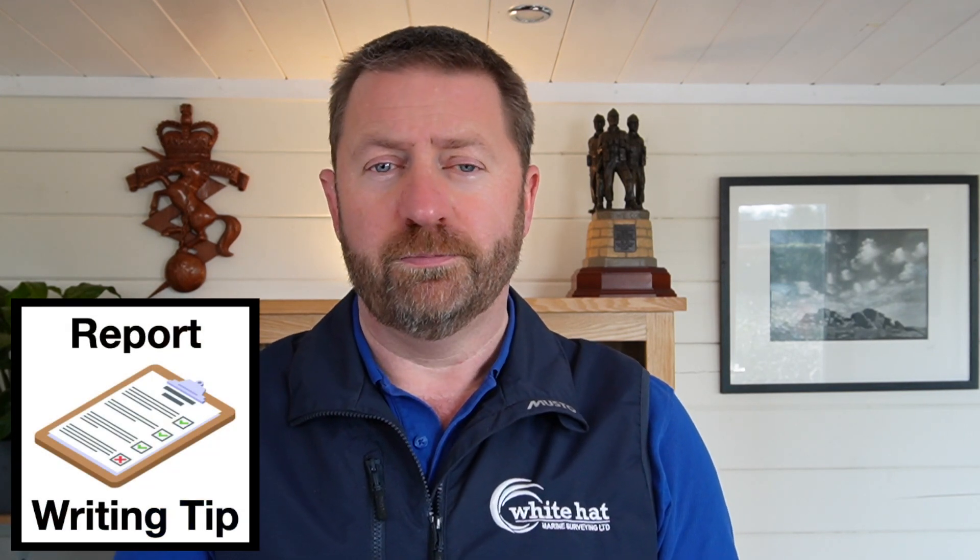The last thing we need to do after checking the rudder is record our observations in a manner that is quick and easy to do on site but contains enough detail to help in writing the report back in the office. I've always been a fan of writing in pencil on a paper template on a clipboard — it works pretty well even in light rain, it won't run and it doesn't need batteries. Some surveyors prefer digital templates, some use dictaphones with software that generates text from their spoken record, and some use typists on the other side of the world to write their first draft overnight. My advice is try them all — find out what works best for you.